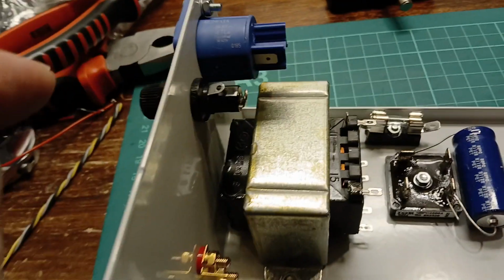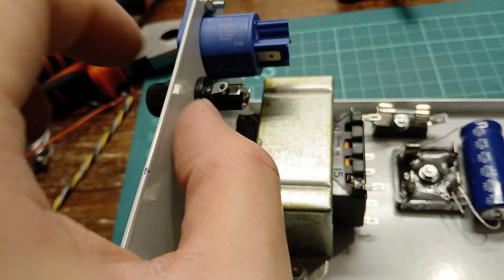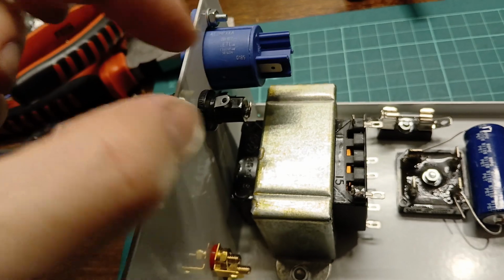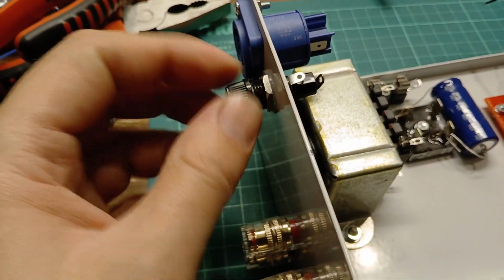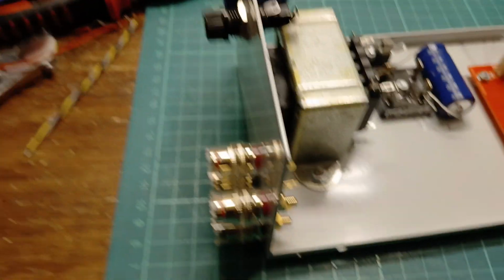It's like the fuse holders. They have like two little wings on them. I find if you drill the hole and get a junior hacksaw blade, put it through and just a little cut that way, a little cut that way, it's perfect for those two little lugs to locate into. And then the fuse holder, rather than having to do it up murder tight so the fuse holder doesn't spin when you're trying to undo a fuse, it actually holds it still.